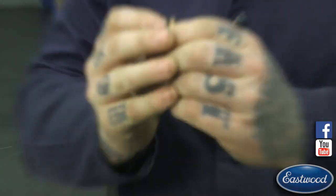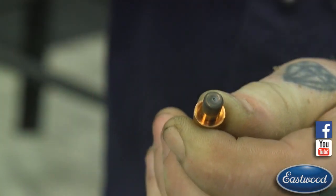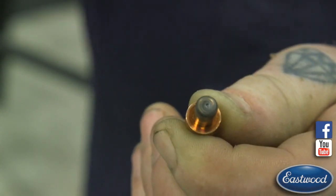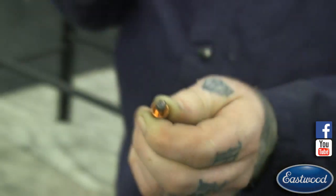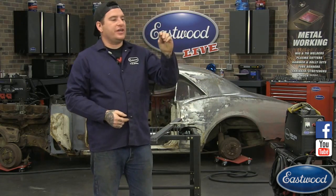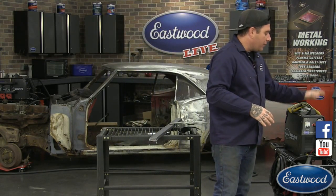You can see on this one — this is the matching part where the actual electrode, or the electrical charge, comes out right in the center of that little dot. If you start seeing that divot getting pretty deep and large, it's probably time to replace it, especially if you're having trouble initiating an arc. I would swap one of these out first and see what it does. The nozzle tip is easy to tell when it goes bad — if you see the hole egged out or really large, it's time to replace it.